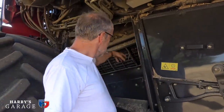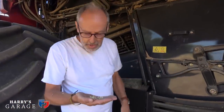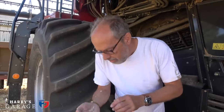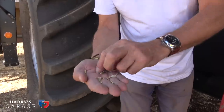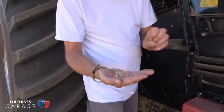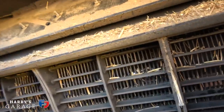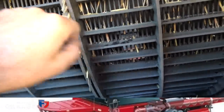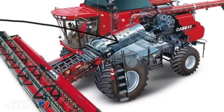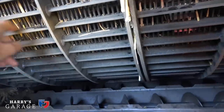So this is where what was the crop gets split into two parts of the threshing job — the grain drops down here and then there's wind from a great big fan under here. You end up with the grain itself mainly like that, and then that goes over some sieves. Let me grab the camera and show you how that works. This is a great big two-meter-long rotor inside there — you can just see a shiny bit — that's beating at about a thousand RPM when you're in wheat.